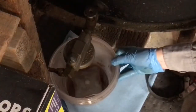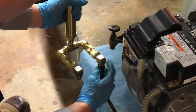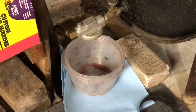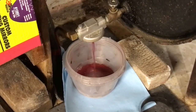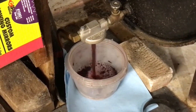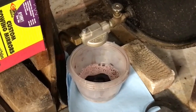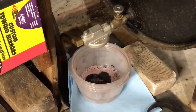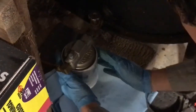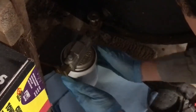Next, place your container underneath the filter holder, then attach the oil line to the push side of your hand pump. Work the pump handle, and any blockages in the line should be blown clear. Put everything back together, including a brand new filter, purge the air from the line, and you should be ready for a combustion test.